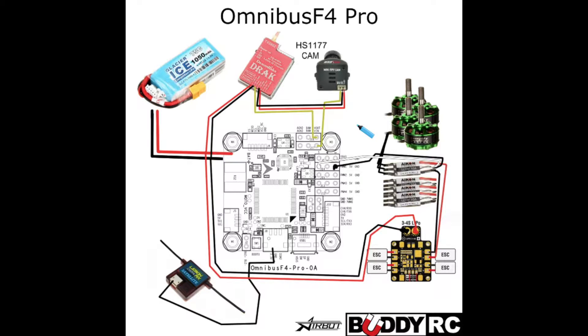The only thing left is to hook up the VTX and the camera, and I'm going to do that in a way that I can utilize the onboard OSD. I'm going to run the camera's video out and run that into the video in on the Omnibus. The video in and out ports are flip-flopped from the Omnibus F4 standard non-pro version, so be careful that you run the camera onto the inside of the board, and then run the VTX video in to the outside — the video out port on the Omnibus. The Dragonrider DRAC adjustable VTX powers the camera, so I didn't bother running extra power and ground wires to the camera or to the board. I just went straight from the battery to the VTX, and then from the VTX to the camera.